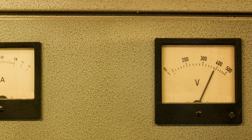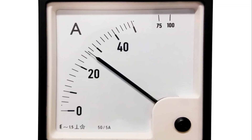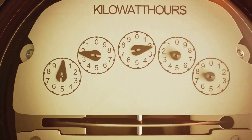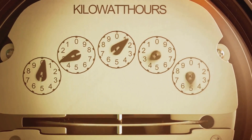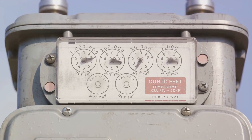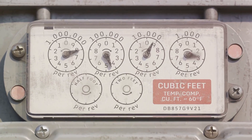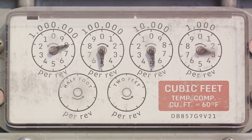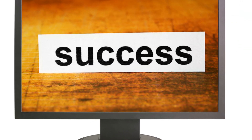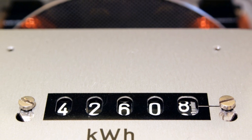It's important to remember that this conversion is for units of electrical current only. A milliammeter and an ammeter measure the same thing, just on different scales — like inches and feet, or grams and kilograms. The physical properties of the current don't change; we're just expressing the measurement in a different unit. You've taken your milliammeter reading, divided by 1,000, and you've got your ammeter reading. Just like that, you've scaled up from milliamps to amps. You're now ready to tackle any conversion between these two units of electrical current.